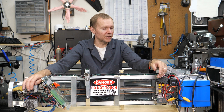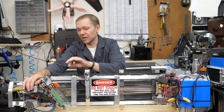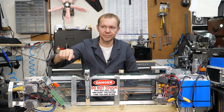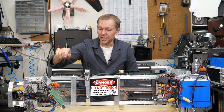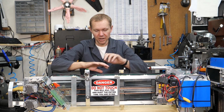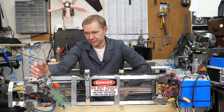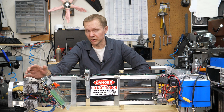At one point I had the wire just laying along the frame, and I would touch it to the input, even though the input was set to input pull-up and had a pull-up resistor on it. I could touch that resistor with just an empty wire connected to nothing, and it would trigger it to fire. So I fixed that by putting a diode on it. Doesn't make any sense, but I did it, and that made it work way, way better.